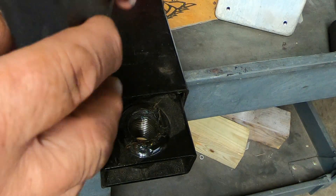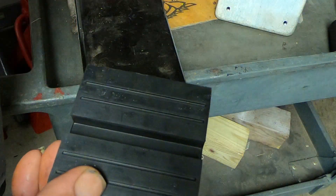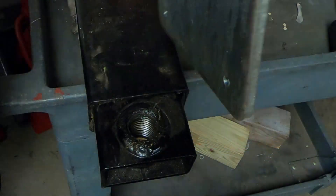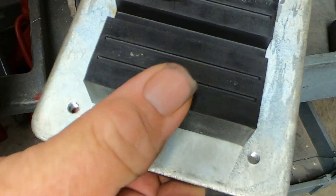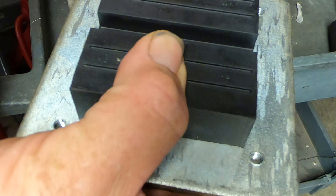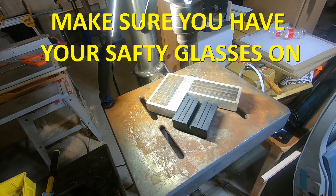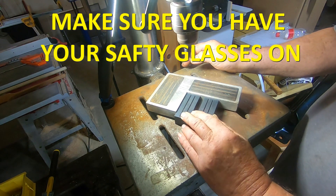My game plan here is to drill four holes in this rubber block, drill and tap four corresponding holes in this steel pad, and attach the block as you see it here. I like this idea because that reinforced pinch weld will fit in the slot and it'll make it impossible for the car to slip. I've got my drill press set up — I have no idea how well I'm going to be able to drill into this hard rubber; it's almost like neoprene.